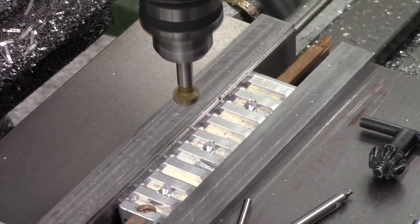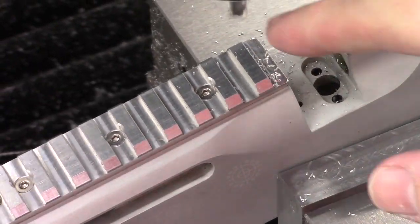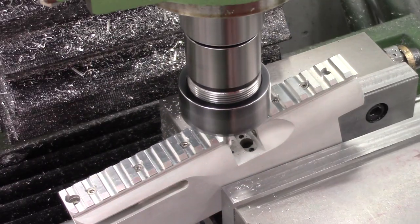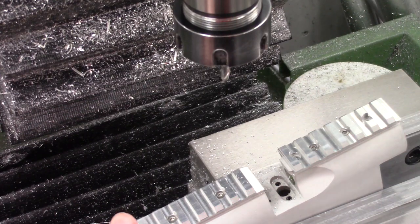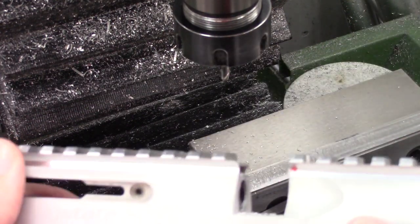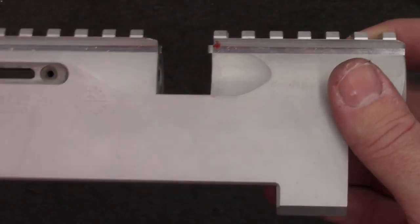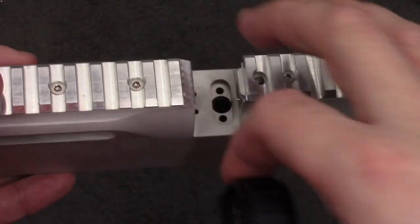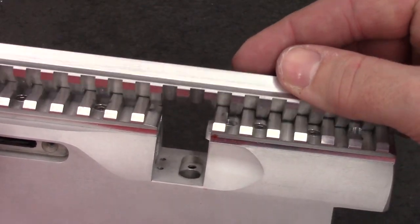And then lastly we can just do some decorative angles just to break the edges up a bit and make it look a little more finished. These are easier to do when the pick rail is actually mounted on the block. I did the front one off camera but it was just the same operation, although in the front one we had the two barrel tension grub screws to factor in, but other than that it was pretty much identical. You can see there the new style magazine fits in no problem and we've also kept the correct picatinny spacings. So that's it for the pick rail — we can move on to the shroud now.